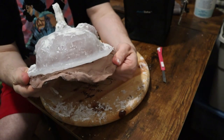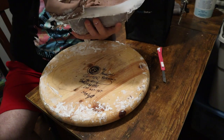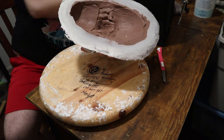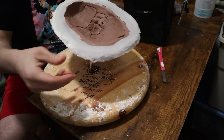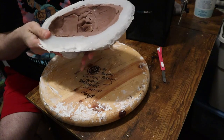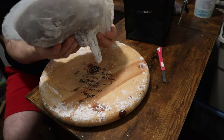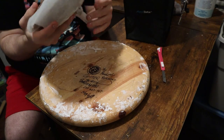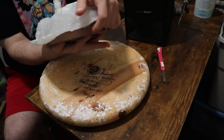This is the second most stressed out I've been in quite a while — but the flange, easy, not a problem. It's off — it can go in the pot, it can be remelted, I'm going to filter out all the crap that's gotten into it. PlatSil Gel-25 is a really tough silicone. It returns to its shape well — Durometer 25, which means it's a little bit harder than PlatSil Gel-10, which is Durometer 10 and is used in some cases for prosthetics.